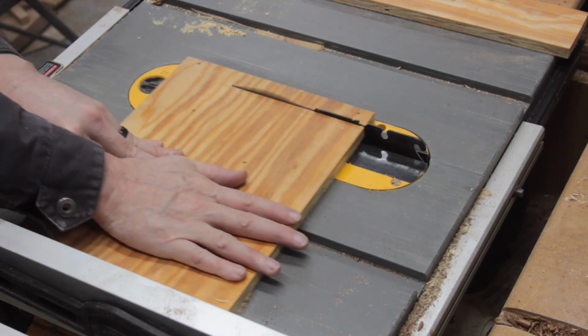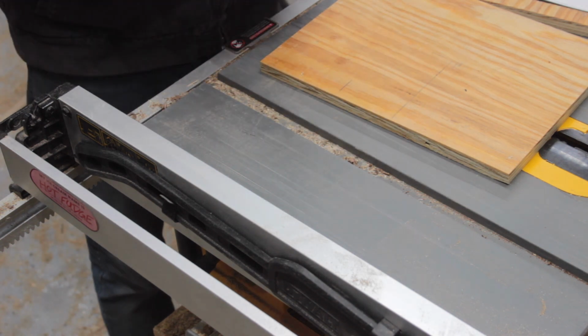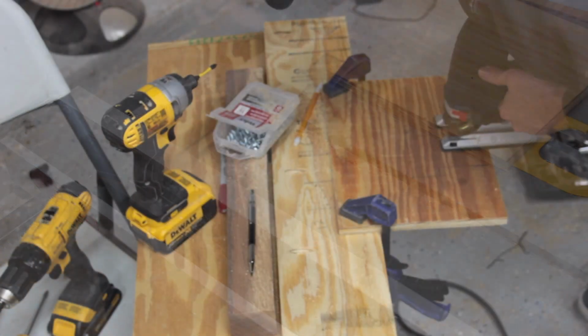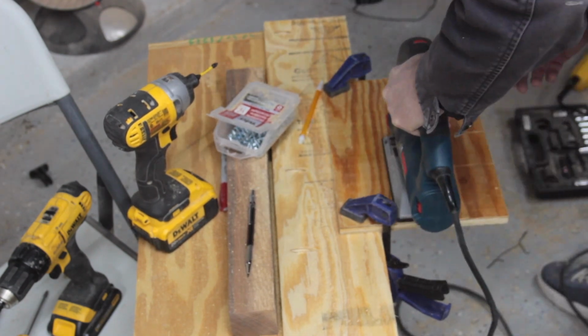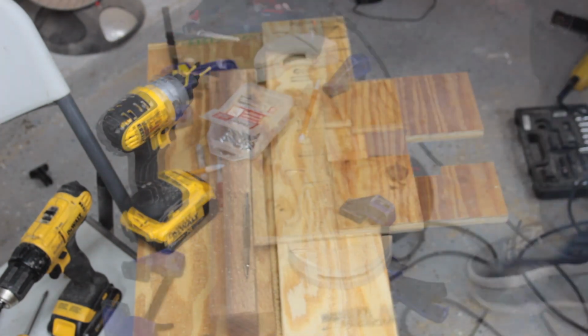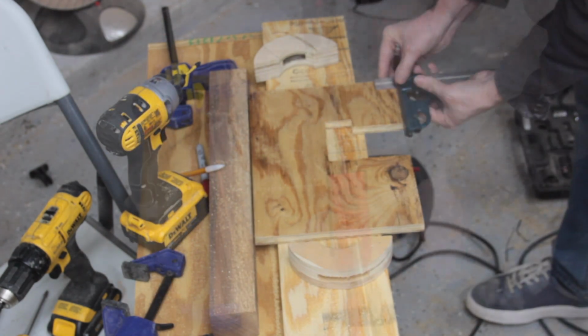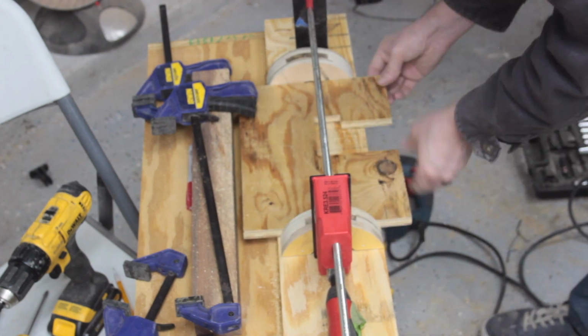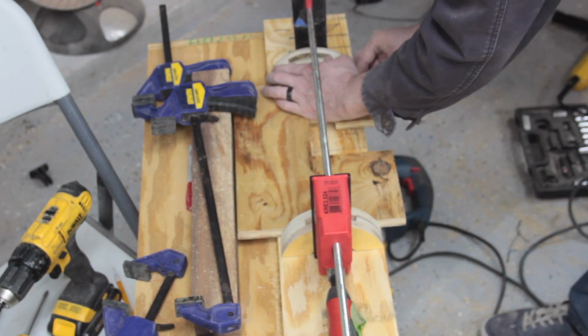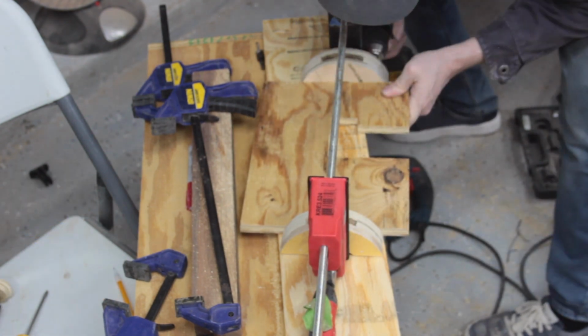Here I'm making the undercarriage. That's probably not the right word, but we'll go with undercarriage for the table itself. This is a spot to let the blower wheel miss it. Also a big notch so we can put the blades on and off. And now I'm just getting the trunnions mounted, making sure they're nice and straight.